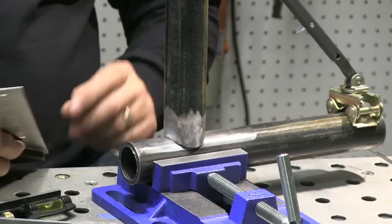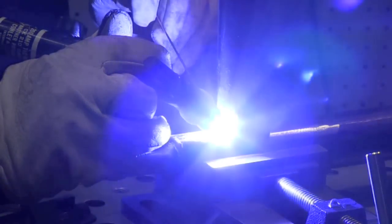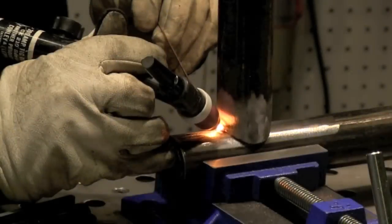I'm going to get a tack right there, and when I do I know it's going to pull a little bit in one direction. So I choose which side to tack accordingly — if it needs to come in one direction, I'll tack it on that side.